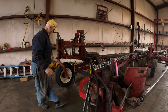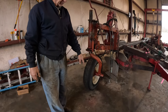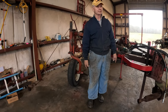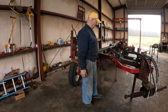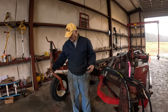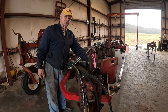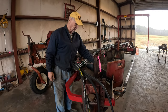It will also give me — if you noticed in part six, I was just off the tire, just off the furrow. Now my tire is going to be in a better place; the edge of my outside tire is going to be here, which gives me plenty of room. That was one of the reasons for moving it over. To rebuild the hitch there were three reasons: this tire was too close to the furrow, it gives a better line of draft, and to add weights on this corner — before I had a chain down on the hitch. This is going to work a lot better.